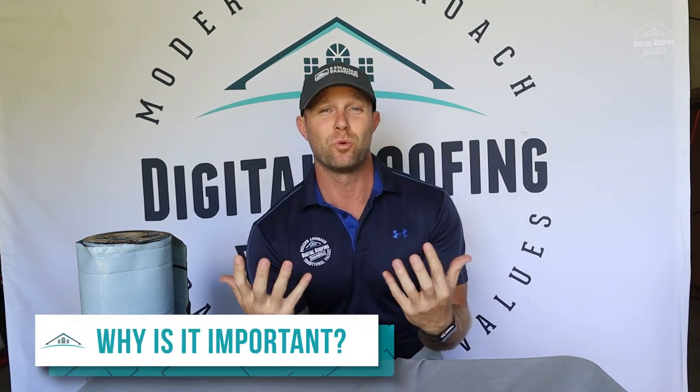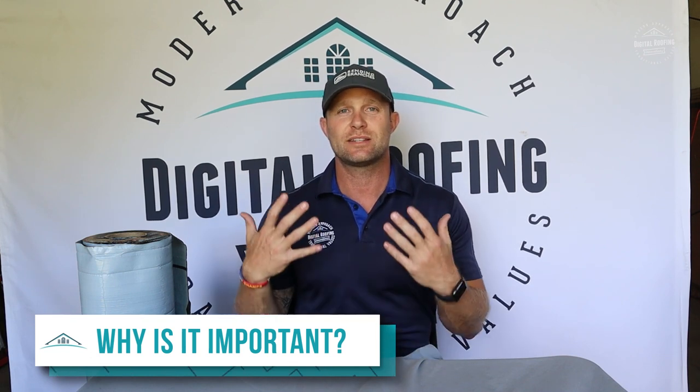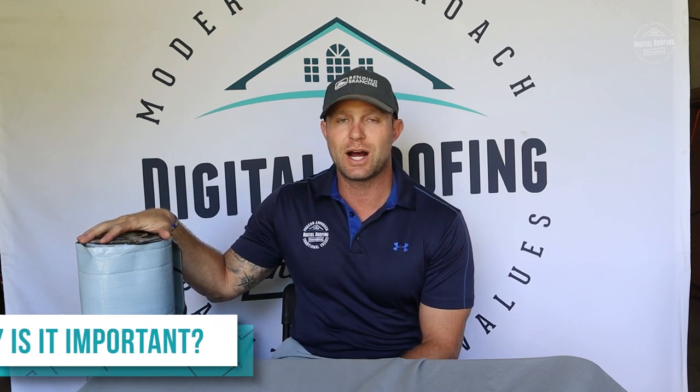Well, we just got off the roof and I told you we're going to talk about, again, why we think it's so vitally necessary to have it on every single roofing system. Well, the biggest reason, guys, is it's just not very expensive. It's a couple of rolls of this is what's going to take care of most houses. You can find good ice and water shield anywhere from $50 to $100 a roll.